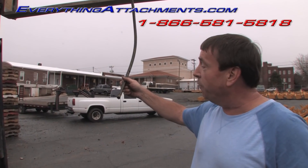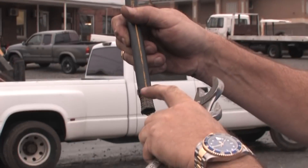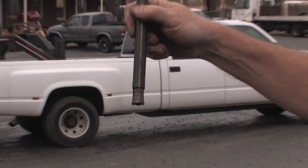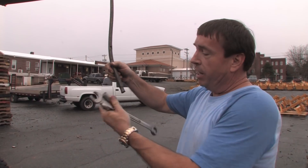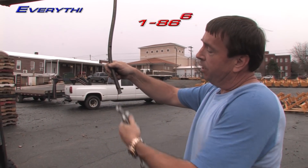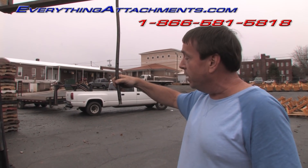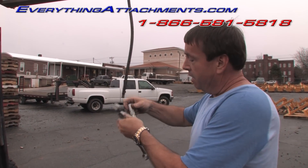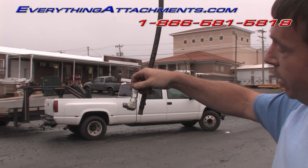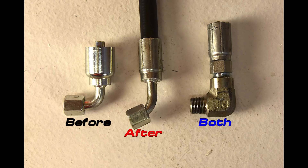Even though this was a perfectly crimped hose because I did it myself, crimped in a Parker hose machine, the hose stretched way smaller than its normal diameter and we simply did way more than what we were supposed to do. What it did was it left the rubber inside the coupler and jerked this off. That was probably around a 3,000 to 4,000 pound jerk when you're bouncing it like that. You can expect something to fail at some point, but the fitting is not what failed. So we're going to stay with these instead of the JICs at Everything Attachments. See you next time.